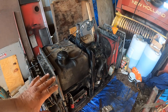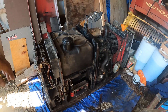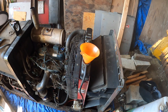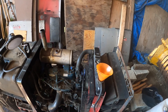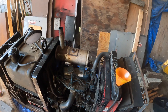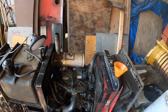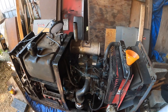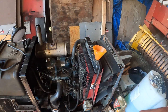It's all put together. The fuel tank has been put together; it was cleaned out real good — I did it about three times. Had to rinse it out real good and swish it around. Got it bolted in, got all the fuel lines hooked up. Need to put some radiator fluid in it right now. I'm going to check the wiring diagrams, making sure I've got everything, especially on the starter side to the alternator — something's confusing me. I'll check the oil, and the battery's on the charger right now; it's been sitting for two months.